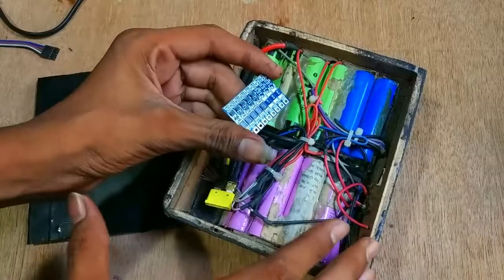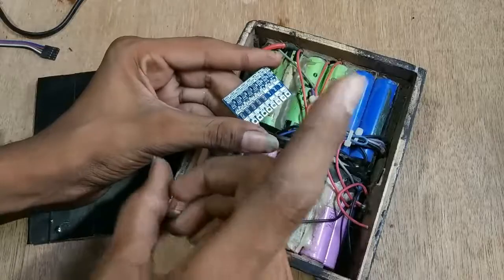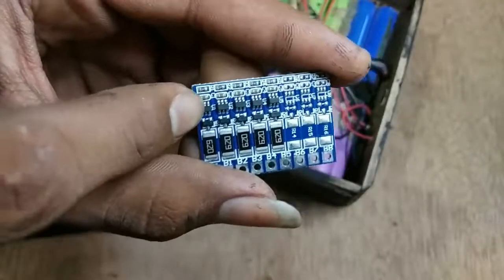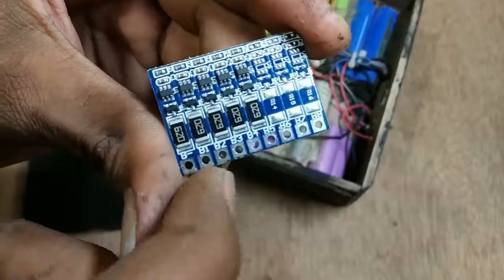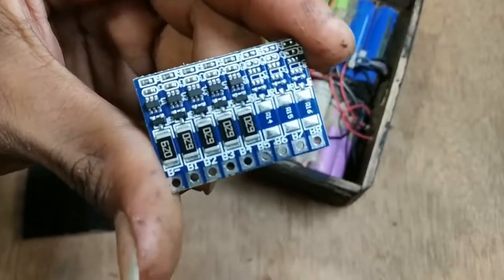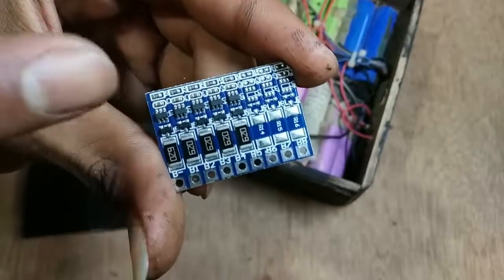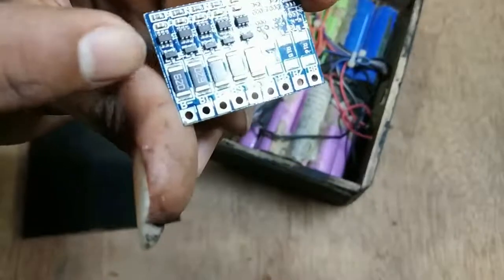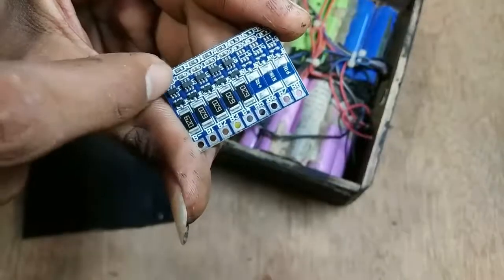Now with this on my battery pack, I could charge my battery without any worries. So how does this thing actually work? The IC combined with a small resistor and a capacitor measures the battery voltage. When the battery voltage reaches its threshold voltage — which is 4.2 volts, the full charge voltage of lithium batteries including lithium-ion and lithium polymer — it triggers the transistor, which shunts to a fixed 20 ohm resistor, maintaining 4.2 volts balanced across each cell of the battery pack.